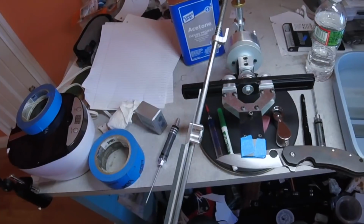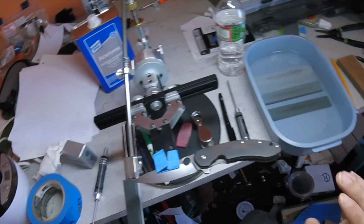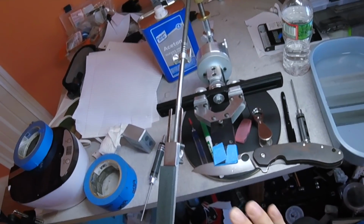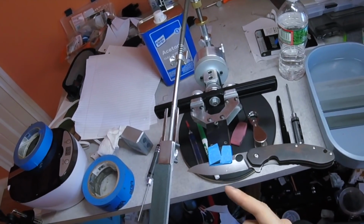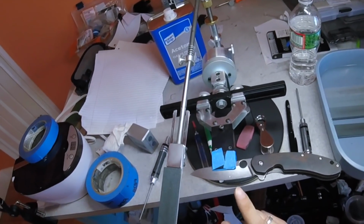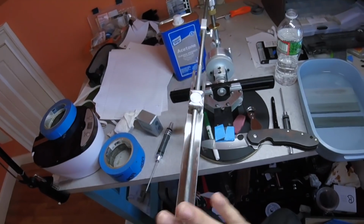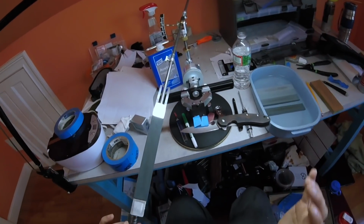What can happen, especially if you use pressure, and this has actually happened to me and I wish I could show you, is that if you're using a very coarse diamond stone, pushing down and building a big burr, you'll damage the edge health so much that later in your sharpening you will get big chips coming out of your blade. I'm not talking micro chips, I'm talking the size of your bevel width. Very large damaged chips. You don't want that. This initial sharpening phase is the most important part. Again, I feel like people don't talk about edge health enough.